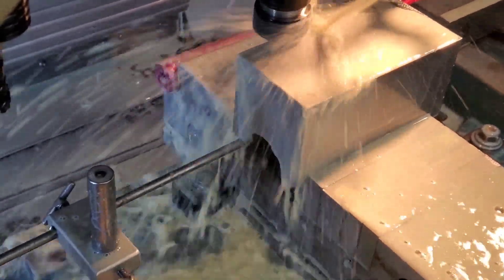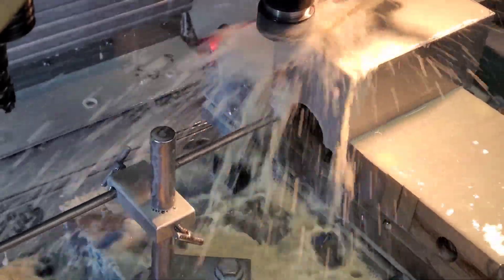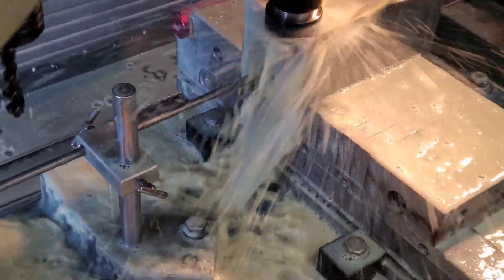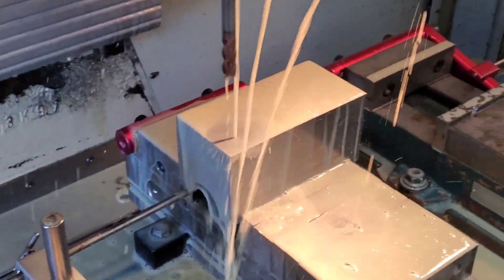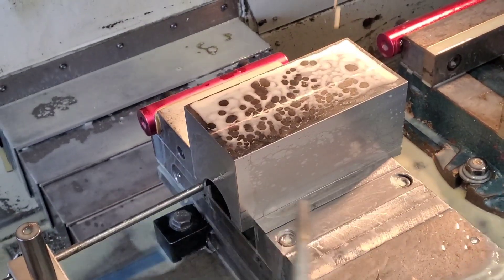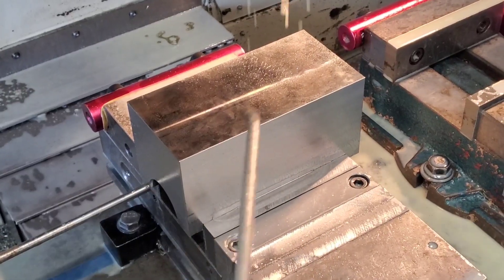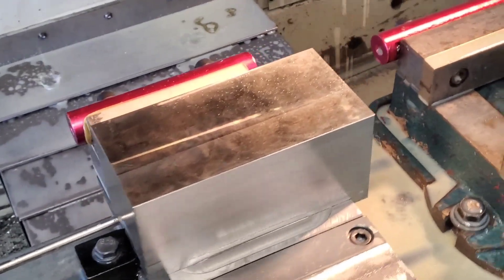You're looking at a flute length of about two and a half diameters and I'm stepping over about two diameters. With this end mill I'm getting a smoother surface finish and little to no taper. I'm also using an ER32 holder. In the future I want to make a video using a more rigid holder, maybe a hydraulic holder, and do some more tests with longer hangout simulating a deeper side mill.